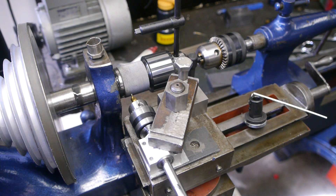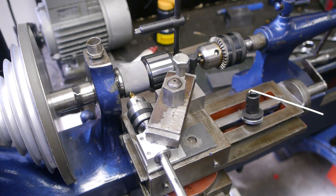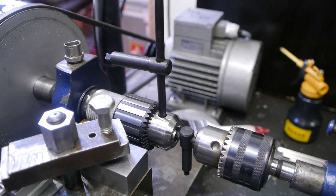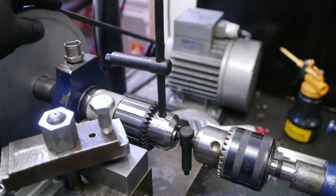This is the setup I've come up with — it has all the potential of things going wrong but it might also just work. I've shimmed up the spindle and it's sitting pretty close to center height, and it shouldn't matter if it's a little bit off. I'm going to drive the spindle with my electrical drill. Too bad I no longer have a working cordless drill — that would probably work better as I have to control the drill with only my left hand and turn the cross-slide with my right hand, so this could get a little awkward. This here is my spindle lock slash indexing setup — there is some flex but I think it will work. The chuck key is my sophisticated indexing mechanism.